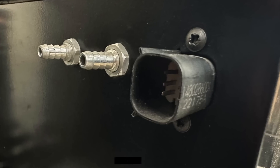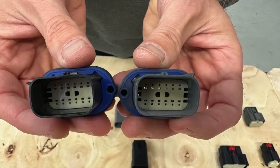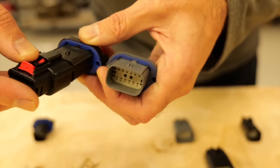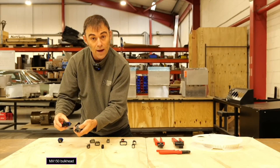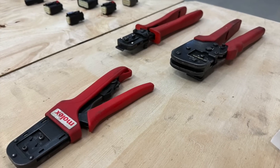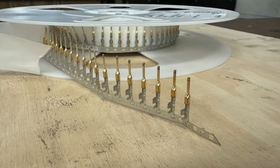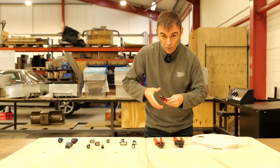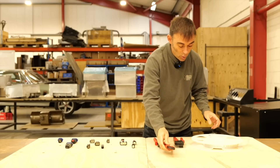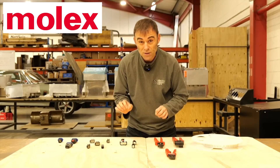On the male connectors there's a little mount so you can fix it in the car, and then whatever connection you need just goes straight in — done. We use a lot of these on battery boxes as well. You'll notice these two are similar but have a keyway, so if you've got two connectors close together you can't accidentally put the wrong one in — it physically won't connect. Really good connectors. Don't forget: always use the right crimping tools, otherwise you won't get a good connection and it will fail. All products — connectors, crimps, and tools — are available from Mouser Electronics. Link in the description.